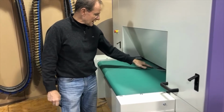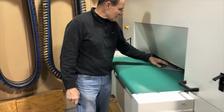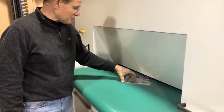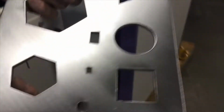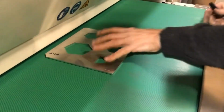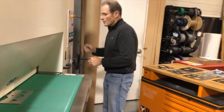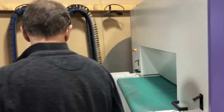Here we see a huge white line, so a lot of radius because it was slow, and it takes the burr very nicely, makes a good rounded edge. See it from the aluminum on the thicker part, you can go more aggressive, you see all the debris on the conveyor belt. Super nice rounded edges. On this side, we're going to show you again a little bit of a grain. This is the non-burr side, but we're going to go lighter by one turn, and we're going to go 3 feet a minute. Because if you don't have dross, you can go quicker.